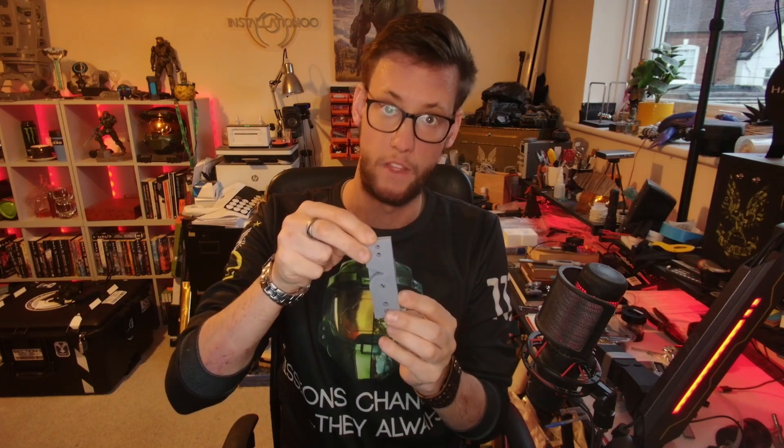These joints are structurally limited — so for example, if this is a knee joint, it won't go any further forward. You don't want to bend your knee the wrong way. But it will go almost to the full 120 degree bend that you need for the knee. The little potentiometer there is effectively just a variable resistor. We can read the electricity coming off of that and how the resistance varies to get an absolute position of the joint at any given time.